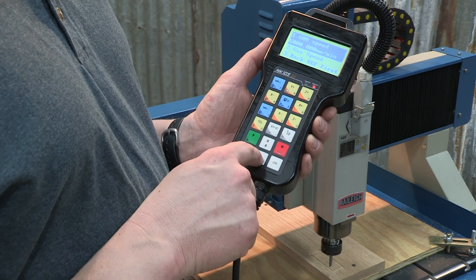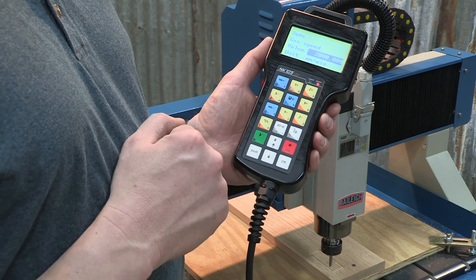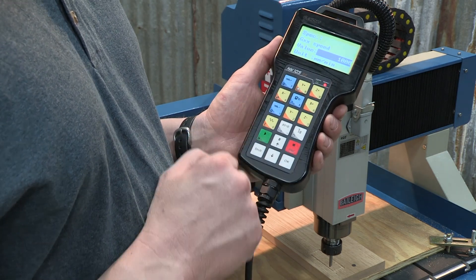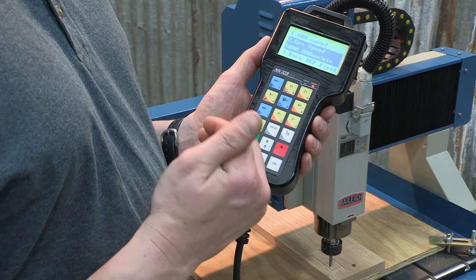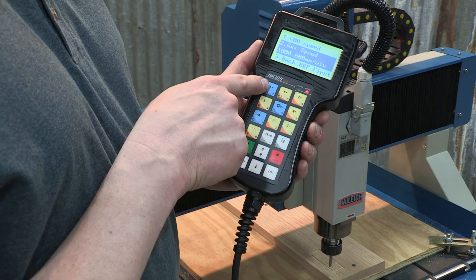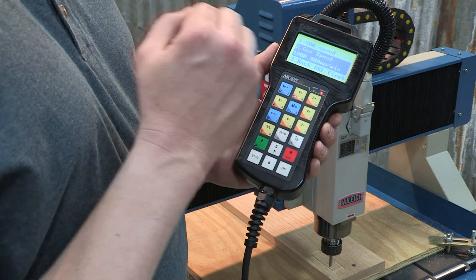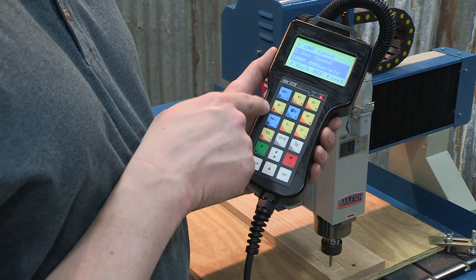The GXX speed — scroll down, select it — is our gantry cutting speed: how fast the gantry will move as it's actually cutting. We'll change this as well. Let's say we want to go a little slower, so we'll put in 1000 and hit OK to lock it in. So when we make manual speed adjustments while the machine is cutting using plus/minus or the number 1 and 7 keys, we now have a ceiling we cannot go past on our cut speed — we cannot exceed 1000 millimeters per minute. We can go down from that, and that's what that adjustment is for.